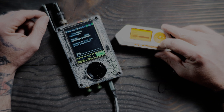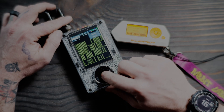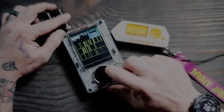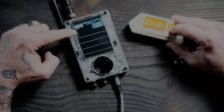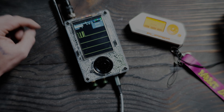Going back, I'm going to long-press and find a sub-gigahertz frequency to transmit. Sub-GHz, go to Saved. I'm going to go to an air filtration system — we are on the 433.92 MHz area. Going back to ProtoView, I'm going to change my frequency up here to 433.92. We are receiving something, but let's see what happens when I hit Transmit on the Flipper Zero. We'll let that clear out on the last of the line. It is now gone — and send. We can see that it sent, and there is the frequency that it was sending.